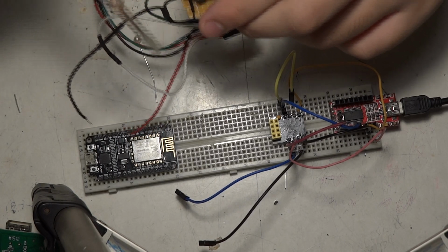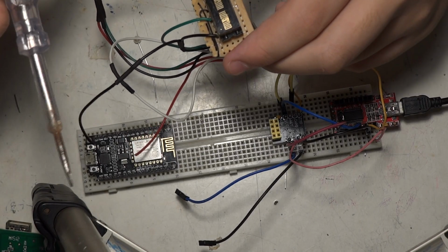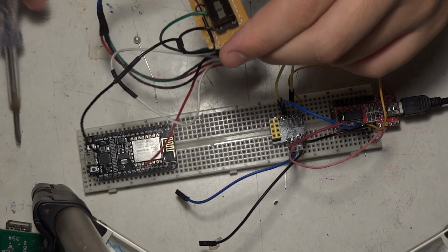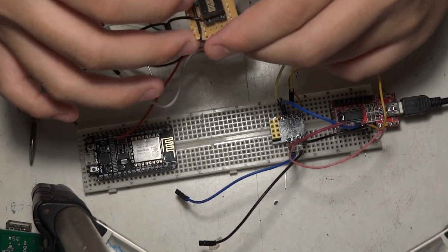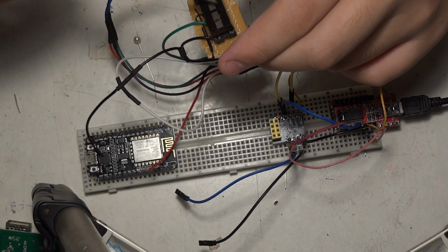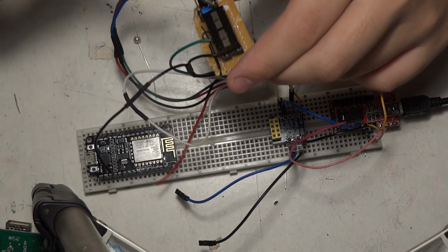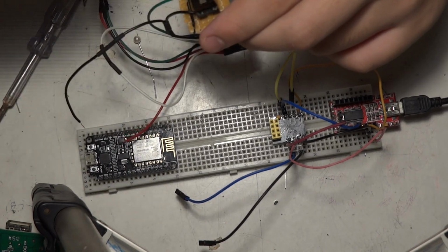So I'm going to use a technique that is used in most electronic things equipped with a screen these days. It's basically like a frame. This display consists of 4 frames. We're not talking about multiplexing because it's more complicated. We're talking about the fundamental part that can create fake grayscale. For example, TLHX: we have 4 characters, each character can be its own frame. The first character is the first frame, the second is the second, then the third and fourth. So we just display them individually and cycle through them very fast, tricking our eyes.